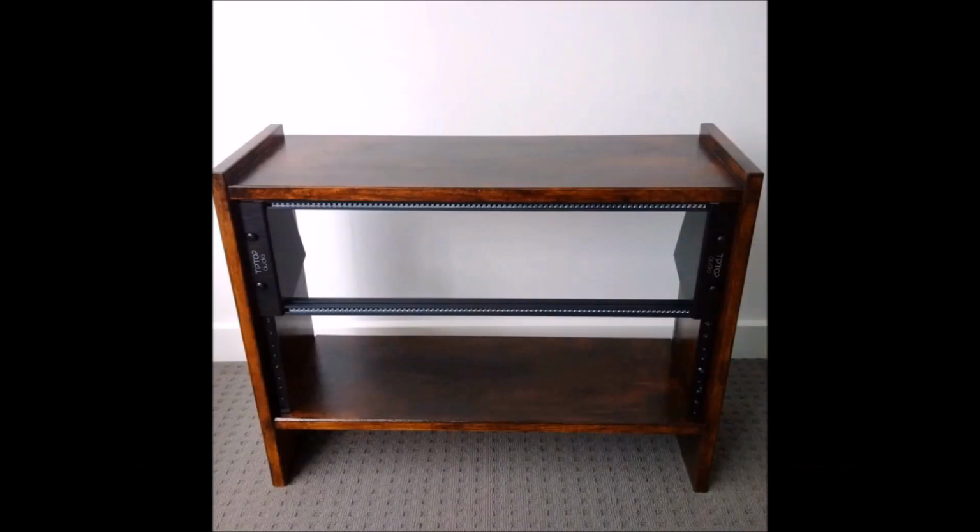So after this step, whether you've sawed it or not, you can choose whether you want to stain it and varnish it. It's not that laminate stuff that IKEA usually sell, so it will absorb the varnish or the stain pretty well. It's probably a good idea to do it at this point before you go any further. Get a few coats on it and let it sit and completely dry before moving on to the next step.